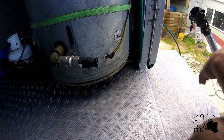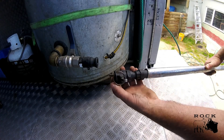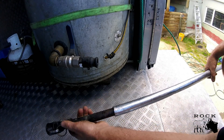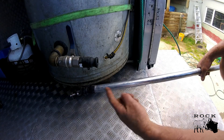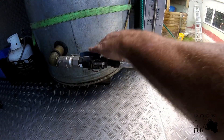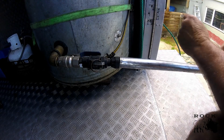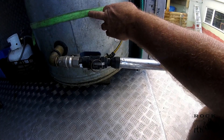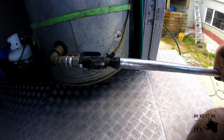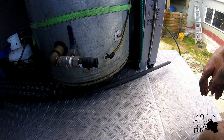Once I'm at the job and I want to empty the water from the hot water cylinder into the scalding tub, I have this pipe with a quick attachment fitted to a piece of alkathene encased in a stainless steel pipe — another stainless steel pipe on the end stops the hose drooping because it gets hot. That connects into the scalding tub. Turn it on and the water is heated to 80 degrees at night time and will stay hot all day, probably two or three days. By the time it comes through the steel pipe and into the scalding tub it's cooled to about the right temperature for scalding — just pure coincidence that it works out perfectly.